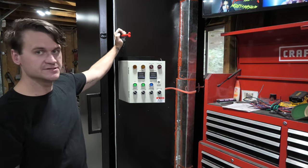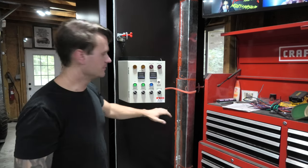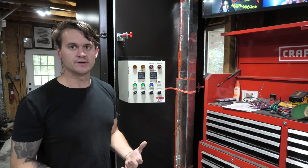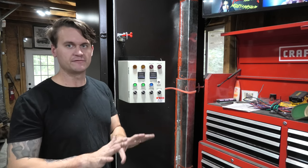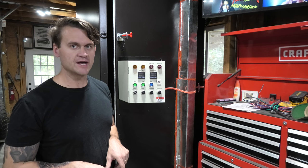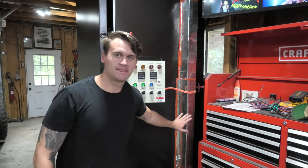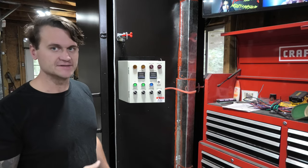You can see the latches on the oven here. And then you can see next to it, that's that duct that I built, all of this here. So again, you saw me, I just literally folded some piece of really thin aluminum ductwork. It folds super easily by hand. So I just folded that up, made a little flange, riveted it into the side of the oven, a few points all the way down. And then I ran this red high temperature silicone sealant around the side of it to provide a little bit of heat sealant on the inside of that.